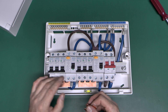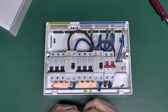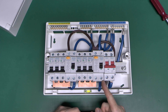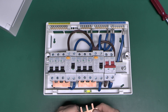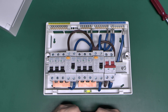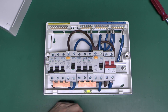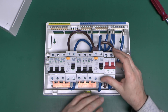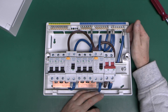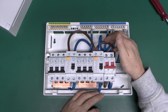On the large units with up to six on each side, there's a set of different combinations you can put in. You can also put another circuit breaker between the main switch and the first RCD, or put an RCBO in there. But really, if you go to the trouble of having three sections and some RCBOs, you may as well just ditch the twin RCD arrangement completely and just put RCBOs for the whole lot. Another reason I don't particularly like this arrangement is because of all this mess of cabling inside - all these blue and brown wires in here, which is necessary to link to the various devices.